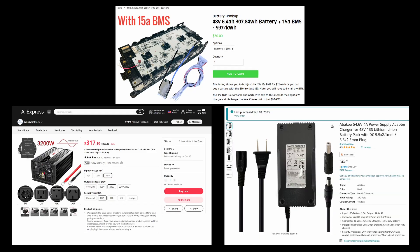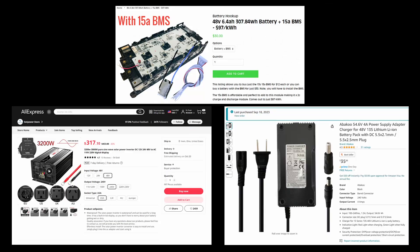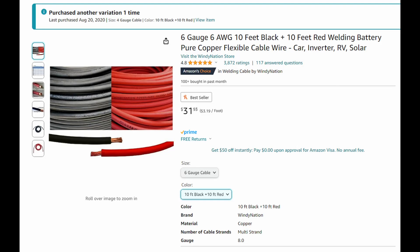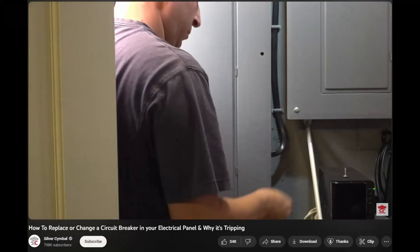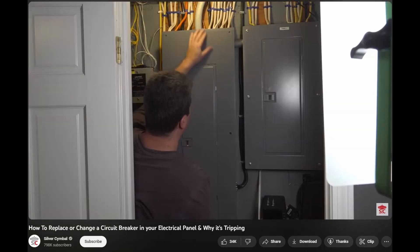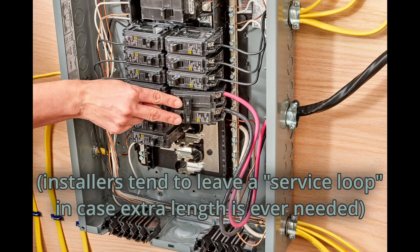There are certainly other things you could include in a system like this — not least the capacity for solar powered charging — but as this video is primarily focused on value, I want to first show just how capable the bare minimum system can be. For that, the only other thing you strictly need is the proper cables. For the batteries, some high quality 4 or 6 gauge copper wire should do fine. I recommend getting 20 to 30 feet of wire, a box of ring terminals, and a hammer crimper to make your own cables. You can open up your breaker box to check what wire size is used for your well pump — odds are it's standard 12-2 Romex. There's a fair chance there will be enough extra length to pull it down and wire it directly to your inverter. And there you go — your well pump has a battery backup.